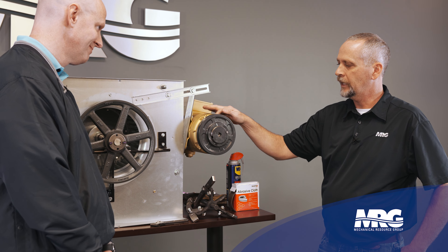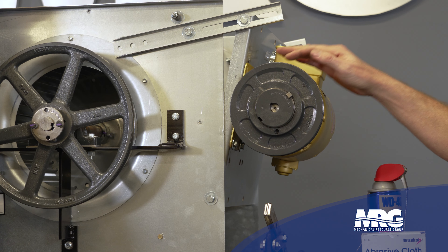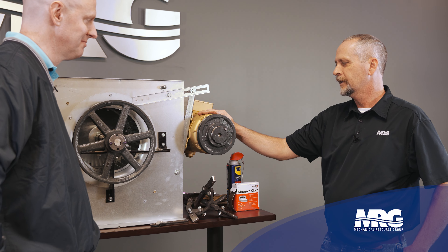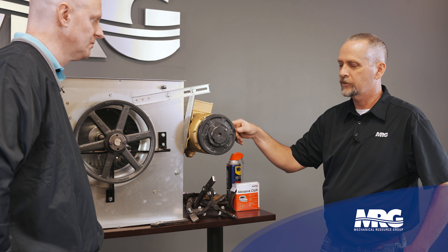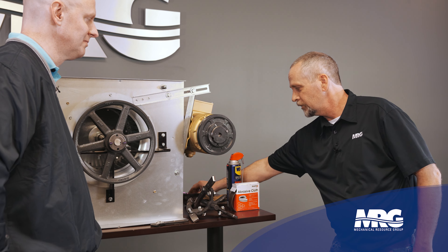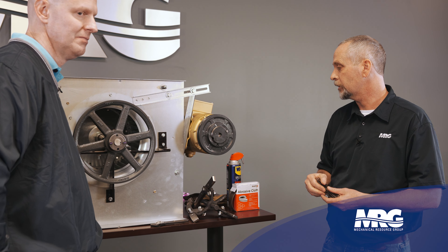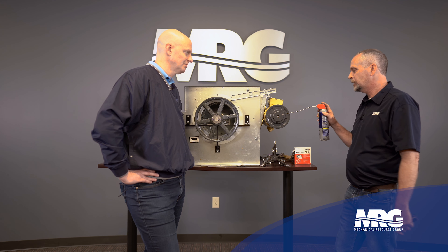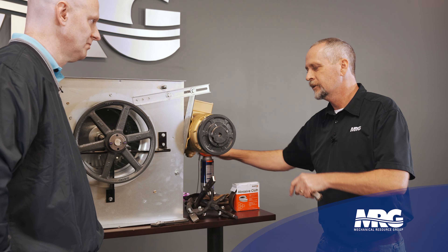Okay, now we're going to talk about removing our motor sheaves. This is a little bit different setup — we have a set screw back here that is screwed down onto the motor shaft, which keeps this from moving. So first thing we want to do is loosen that set screw — I've already done that. A lot of things to be aware of when removing these set screws on a unit that's been in service a long time: they will be very tight. As soon as you get started and turn everything off, go ahead and shoot some penetrating oil in everywhere, let it set for a few minutes while you go get the rest of your tools out of the truck. Soak it, soak it, soak it — best thing to do.